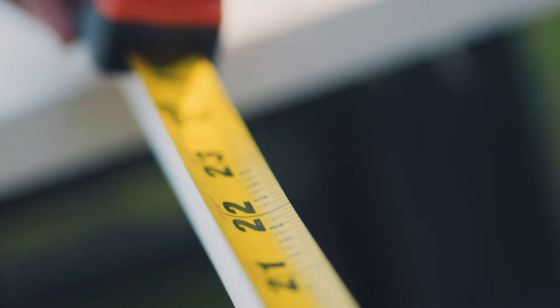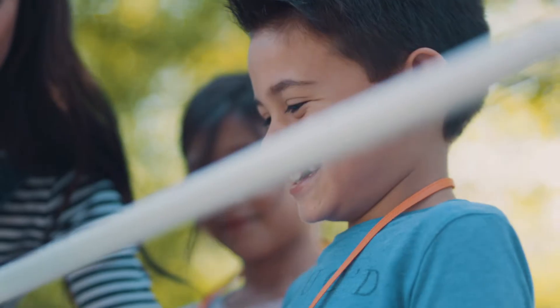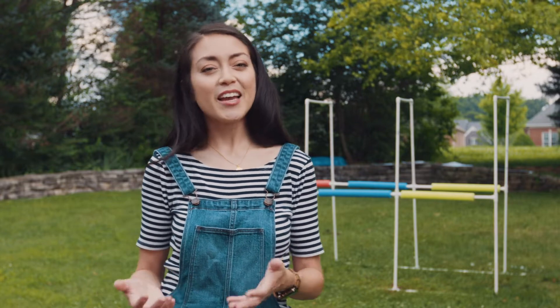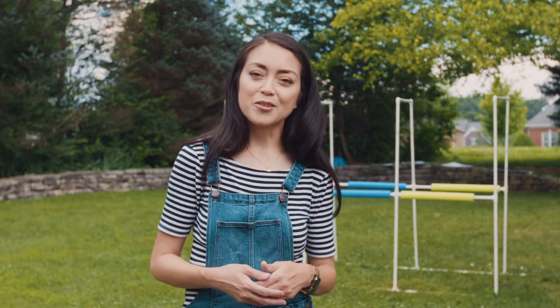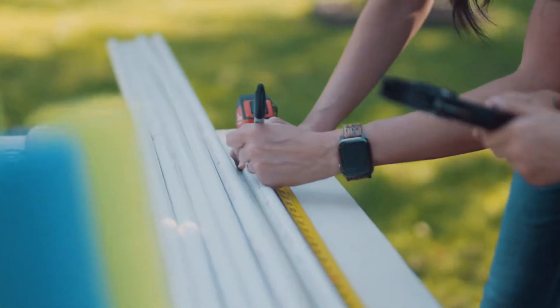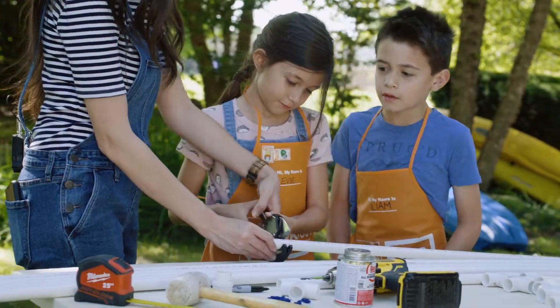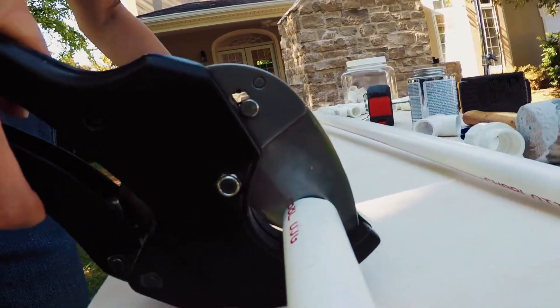The first thing we're going to do is measure, mark, and cut the PVC pipe. I'm using half-inch PVC pipe, which works great because it's smaller — which helps keep the water pressure up — and it's lightweight so it's easier to handle, maneuver, and store. PVC pipe often comes in ten-foot lengths, so I designed this project to make the best use of materials. Each part will be 30 inches long and you'll be able to get four pieces out of one ten-foot pipe. You can cut the PVC pipe with a hacksaw or even a power saw, but I'd recommend using a PVC pipe cutter. If you don't already have one, I'd recommend picking one up — it'll cost you about 14 bucks but it'll make this job so much easier.